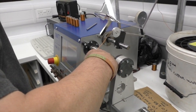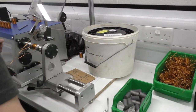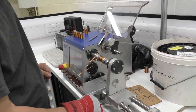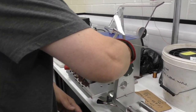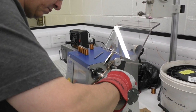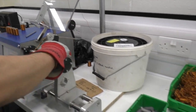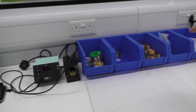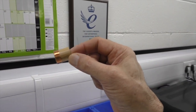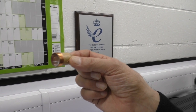I couldn't see how moving coil cartridges would work — it didn't make sense to me. Doing it at 20 times scale proved it. So these are inductors for speakers? The main purpose here is voice coils for loudspeakers. You make those here too? We do that because we wind four and eight-layer coils, which is impossible with automatic machinery.